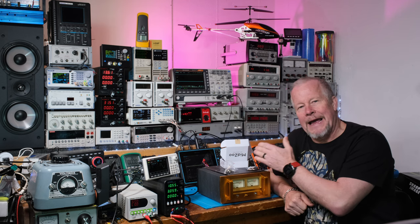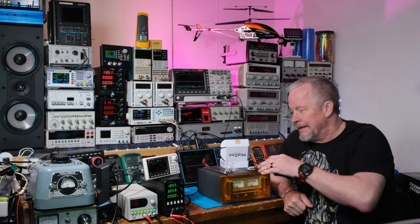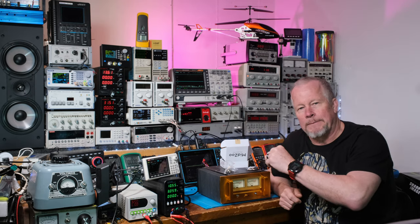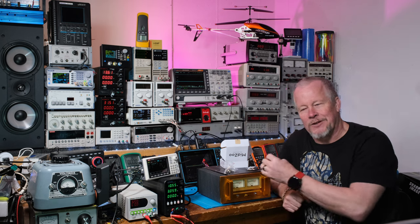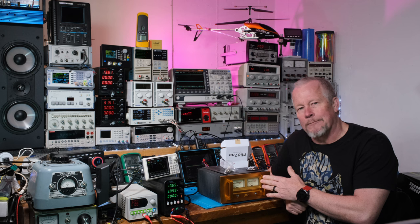There's a heat sink on it and I was kind of squeezing my big hands in there — there's no space — and I bumped the op amp and knocked it off a little bit. I took it off to straighten the leads, put it back on, and put it in upside down of course. With the heat sink on it, it's hard to tell where pin one is, so I flipped it by mistake.